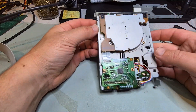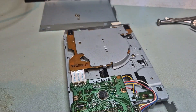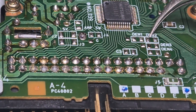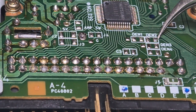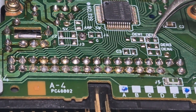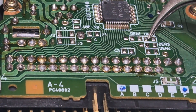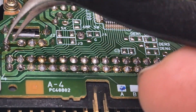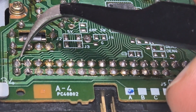So we've got a small PCB here. Let me zoom back in. To mod this drive for an Amiga, first we need to jumper this area here. We just put either a big solder blob or, in my case, I like to use little bits of wire wherever I can. Then we need to cut two traces, so the first one is pin 34 here.